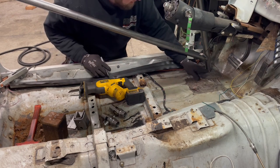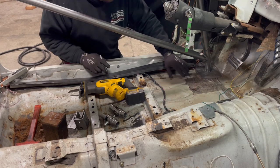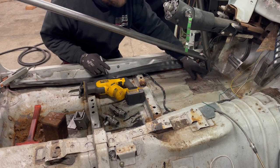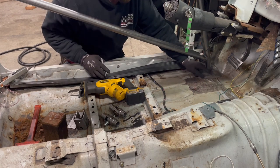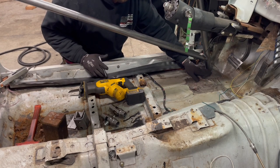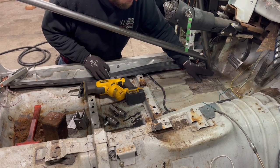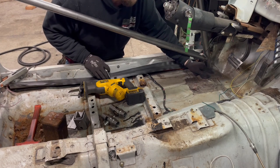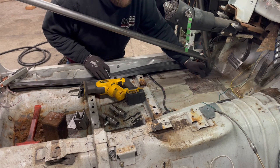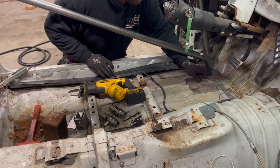One is I tack the tubes to the floor plates in accessible places that I can come in with a cold chisel and break these off. And I do that with a cold chisel and not with a cutoff wheel, because a cutoff wheel will remove material from the tack. And the idea here is that with a cold chisel, we'll break the tack so that when we put it back, it can kind of index itself on that break.